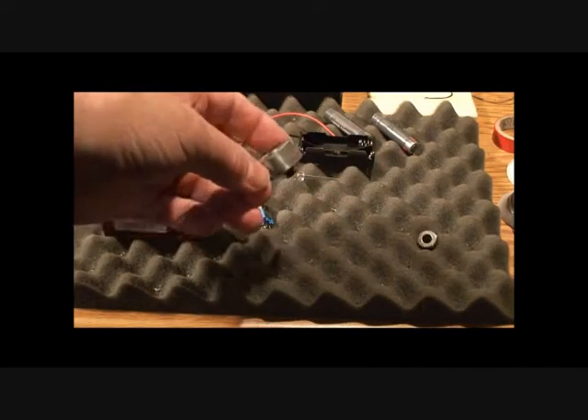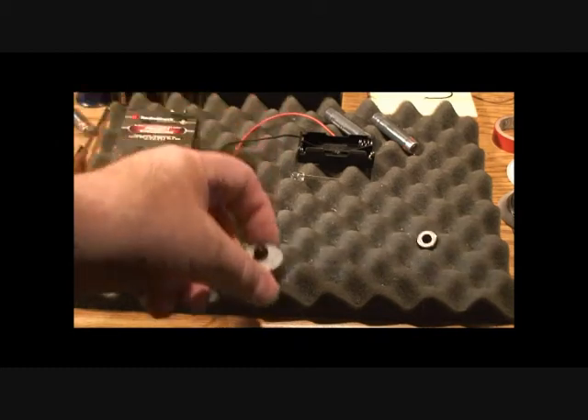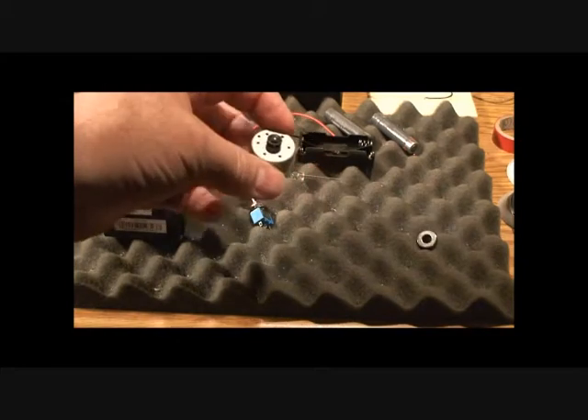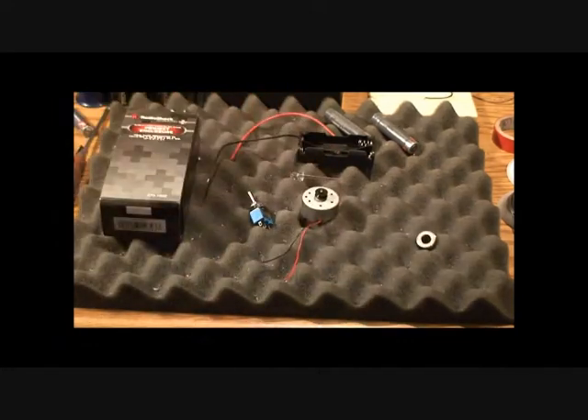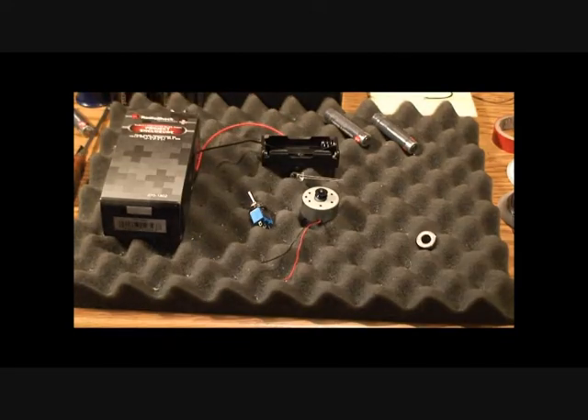You'll need a basic DC motor — something that's going to run on three to twelve volts. I've used a variety of different motors, but I've settled on these because they fit very nicely inside the box. These in particular come off Xbox 360 tray motors — the ones that open and close the tray. So if you have a dead Xbox 360 laying around the house, you can open that up and get the little motor that opens the CD tray. You'll also need a battery connector; these run on double A's, so that's a three-volt load.